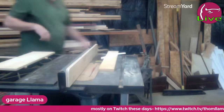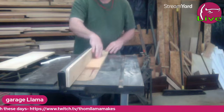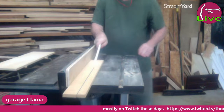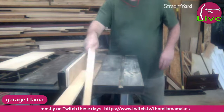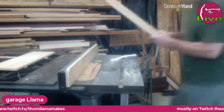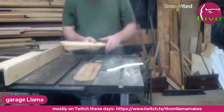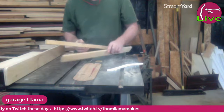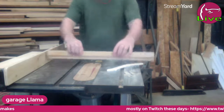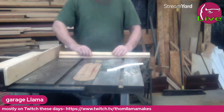Running the saw! The blade's not quite straight yet. See, the fence isn't quite straight, because it's pinching at the backside, but it's minor. It's very little. So, we want this at the top. And the reason you want it at the top is because when I run it through, it's going to cut a slot. And you want the strength at the top because the bottom won't matter because it'll be cut in half.